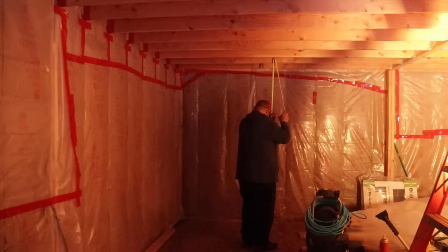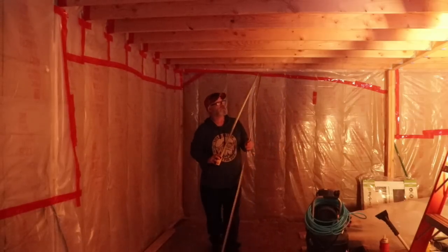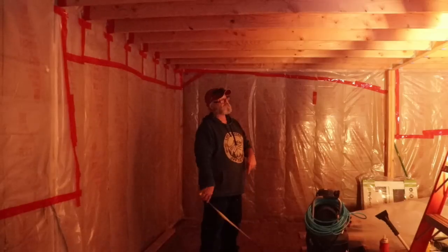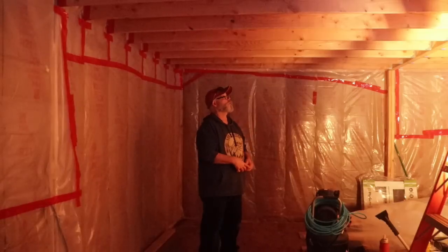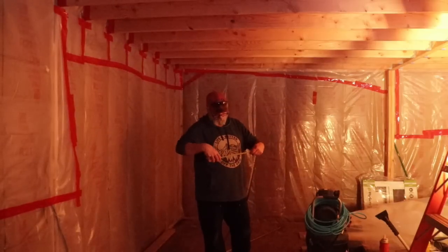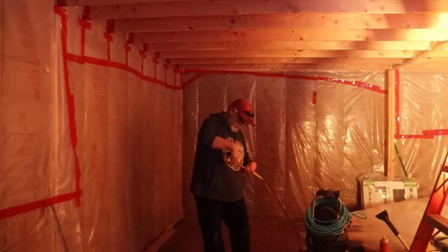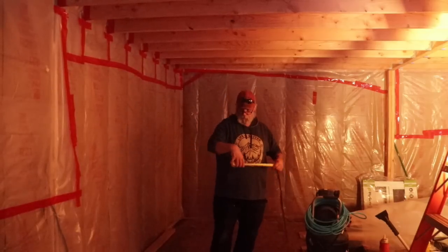And I know it's not the most accurate thing because I'm not using a level while I'm measuring, but I'm doing the same thing on everyone, so I can get pretty close. So we're looking at 7 feet in total height from the floor to the top, and I'm going to cut that back by a quarter of an inch so that I know it's going to slide up there. According to Ward, I pick up about 1/8 of an inch when I nail two boards together anyway. So, like I said, that's 84 inches. I'm going to go 83 3/4